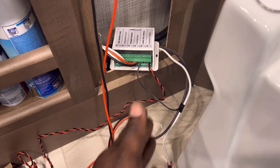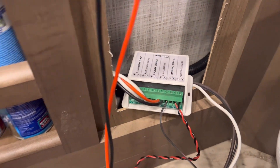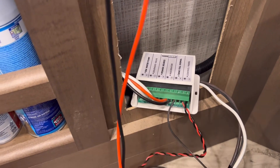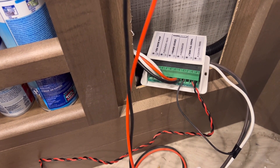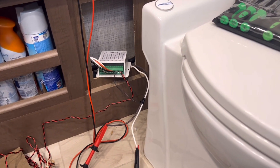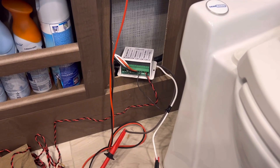Right at the halfway point I can see my problem. Now I'm going to troubleshoot this box by simply disconnecting each device one at a time - I have to take them off anyway because the wires are frayed and need ferrules. When I get to the point where I take something off and my voltage goes back up, I know that's the circuit with the problem. That's my old-school troubleshooting method when I don't have schematics at hand.